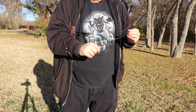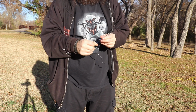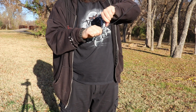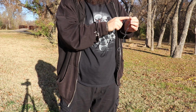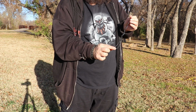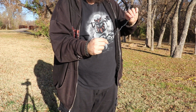Every time I'm moving it, I'm untwisting the wire. I hope you can see it against my shirt here. Then taking it up about 1.5 inches. Then I'm gonna retwist the wire up. Twisting the wire back on itself like this is going to take the power going through the antenna and use this part as that part of the antenna. So it's no longer extending your antenna wire down. It's treating this section as a part of the wire itself.